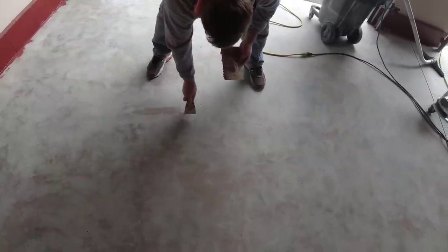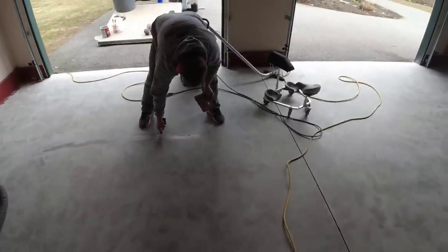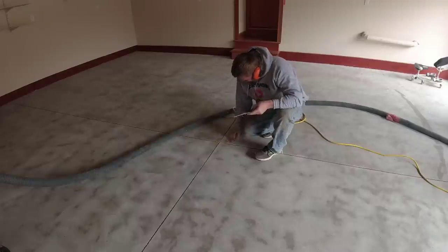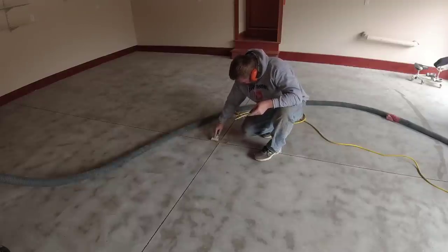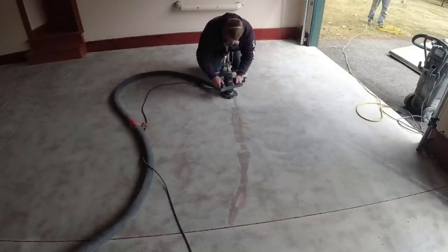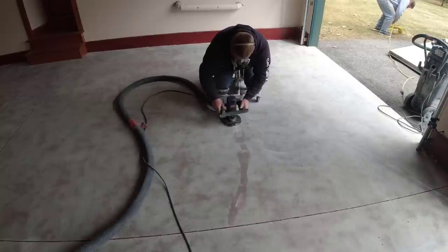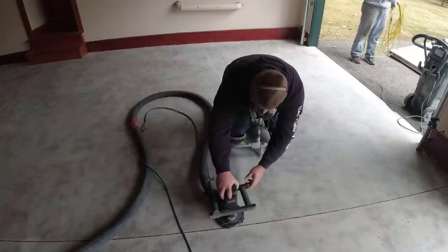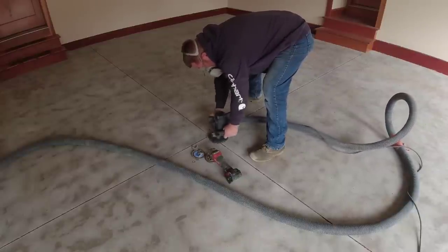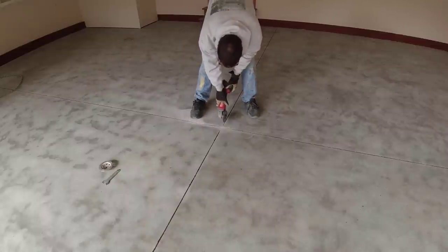You can see the type of surface it leaves when you grind it off. What Darren's doing right there is filling in some cracks with our secret crack filler. If you really want to know how to do these floor coatings the right way, step by step, I do have a garage floor course down in the description below. What we're doing right now is filling in any cracks, little holes, chips in the saw joints, just to get everything cleaned up. That stuff dries really quick — about 15 to 20 minutes — and we can grind it off. The crack is filled in really nice, and then we'll get that little scored part ground clean and recut the saw joint right there.